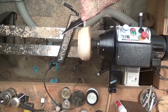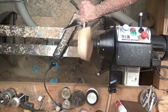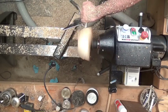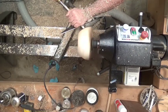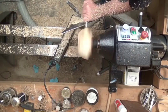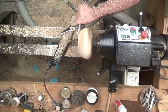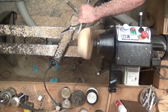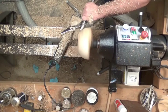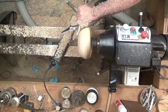I don't want to go into the bark and potentially blow it out. I'm trying to ride the bevel as best I can and have the bevel contacting the wood to support the cut. A little bit of shear scraping — I'll do a combination of both. Shear scraping gets rid of a lot of those tool marks, gives you nice fine shavings and eliminates a lot of the tear out. As you can see on the back of my hand, very fine shavings.